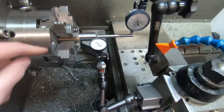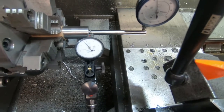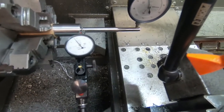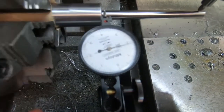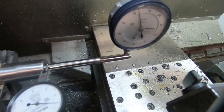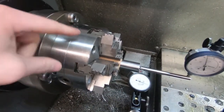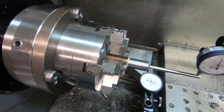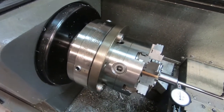With everything clamped up, we've got dual indicators on there. I have a precision ground rod that fits into the barrel about three inches with bushings that match the barrel ID, and it sticks out about four inches. These are both one ten-thousandth indicators placed on this rod. One is showing about three and a half thousandths at the muzzle tip, and the other is reading perfectly zero right now. We'll use these four bolts on the front to change the axial runout. This is a chuck made by Straight Shot Gunsmithing - it's the True Bore Alignment System - and it works very well for getting the barrel set up.